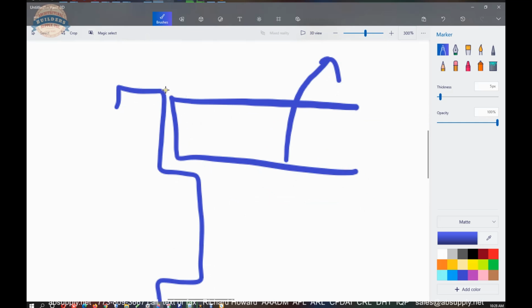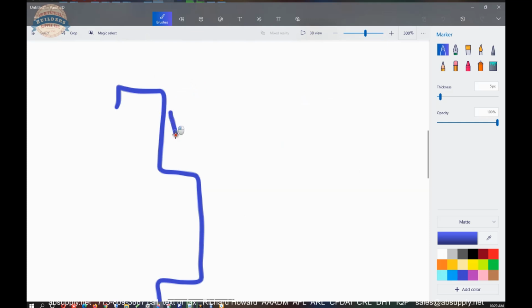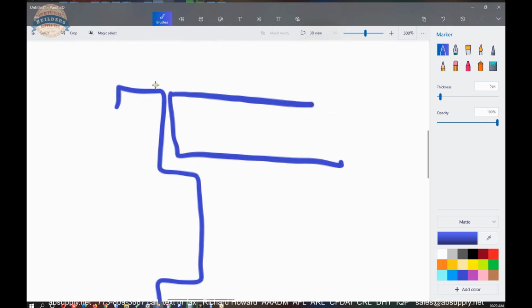And this dimension from here to here, that's called the inset. Well, a typical door has an inset of maybe 1/8 of an inch, not quite, but generally that, or it's 0. Or you could have an inset that is larger for whatever reason. Wood frames could very often have a bigger inset, or what you could really have would be a standard door, but then you have something applied out here, okay? And that's where that offset comes in. Whatever that case might be. Maybe a jamb extension has been added on a wood frame.